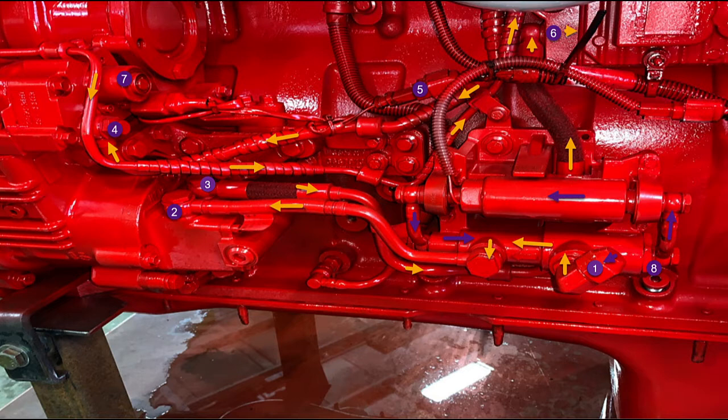The filter on the engine will return-filter fuel to four microns. When it returns, following the yellow arrows heading towards the front of the engine, it will go into fitting four. If you take that banjo fitting out, it has a filter in it. That filter is there in case someone introduces dirty fuel into the engine filter during a service. There is a proper procedure for pre-filling that filter. If it's not followed, the small screen inside that number four banjo fitting is the last chance to keep particles out of that pump — particles that will cause imminent failure to the fuel system. That screen can plug up if something was introduced, and if it does, you could have a restriction causing a 559 fault code. So that's one place to check.